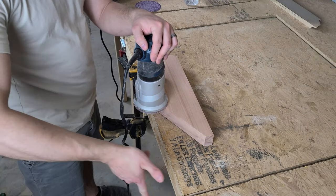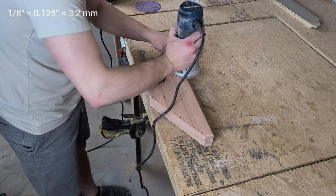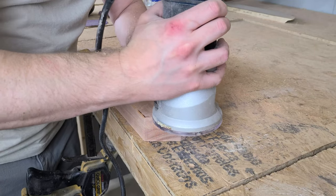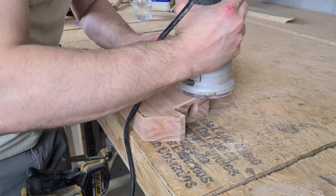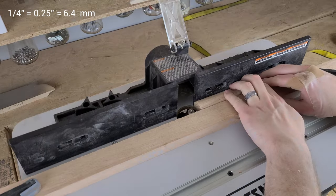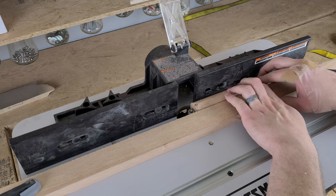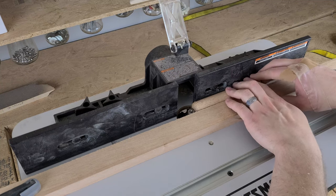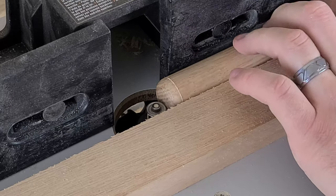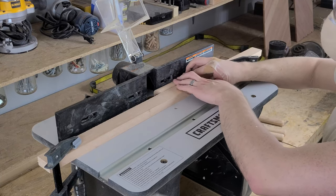With all the pieces made, now we need to round over all of the edges. Starting with the headboard supports, we grab a trim router and chuck up an eighth inch roundover bit. This is a small detail, but it really enhances a piece. The edges feel soft and smooth and look much more consistent and professional compared to just softening them by hand with sandpaper. Next up is the dowel rods. To make their installation easier, we want to round over the ends with a quarter inch roundover bit to give them a gentle lead in. You set the table fence so that the center of the dowel hits the center of your bit. Then you place a second fence on the other side of the dowel to capture it. Start up the router and slide the dowel up to the bearing on the bit, then roll the dowel between the two guides to put the roundover the whole way around.